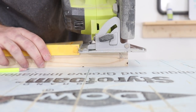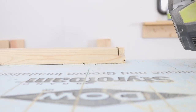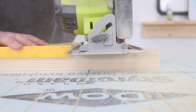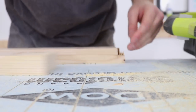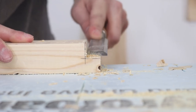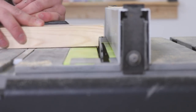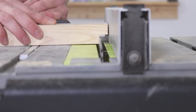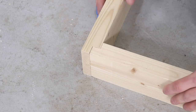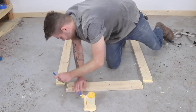To make the corners of the frame a little bit stronger and look a little bit better, I'm using rabbet joints. You can do this a lot of ways. One way is with a circular saw — just make sure your saw blade is set to the correct depth and then take multiple passes to remove all that material. It helps to use a scrap piece of wood in front of where you're cutting so the bed of your circular saw has plenty of wood to sit flat on. You'll need to use a chisel to clean everything out, but it's not much work. A quicker and more repeatable way is with a table saw and a miter gauge. However you choose to cut your joints, make sure everything lines up, your joints are clean, and the corners are square, then spread your glue and clamp everything up.